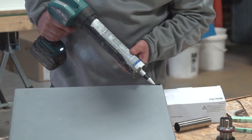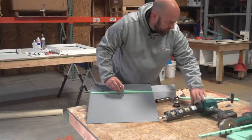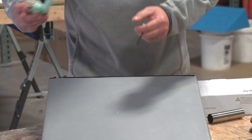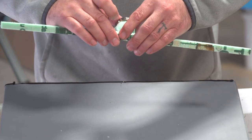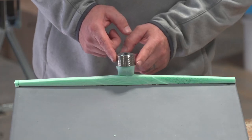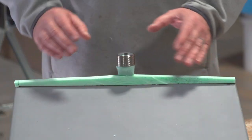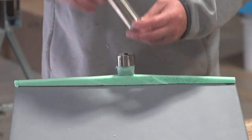Next, we're going to put a real fine bead of caulking right along the top here where this is going to sit. Make sure that you pre-drill this hole right here — if we try to screw this straight into this, it could crack it. So we want to make sure we pre-drill a hole before we actually screw this down. You need a fender washer, and we're going to make sure that this is lined up. I'm just going to take my screw gun. This part here is going to be all encapsulated with concrete, so we don't need these threads at all. We're just going to spray our GFRC all around everything here and kind of make this hole. After we're done, we'll take a grinder and grind this flush, and that'll allow our pipe to stick through here so we can thread that on.